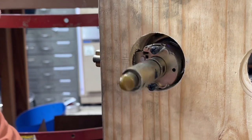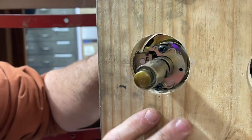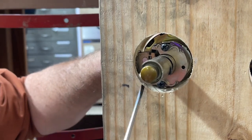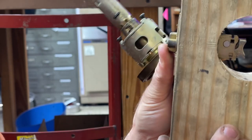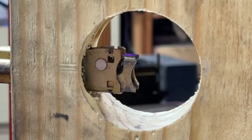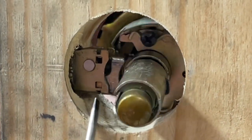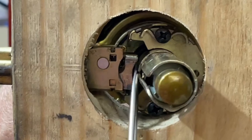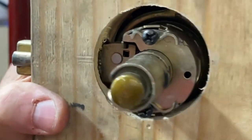This is where it trips up everybody — how do I get that off? Normally, just like with the Westlock, you turn it and it'll let you pull it off. But sometimes it won't, so you do have to be prepared to grab your flathead screwdriver and stick it in there and get it off. Most of the time it comes off fairly easily. But when you press the latch down, it does not pull the bolt in — those are two independent spring mechanisms. The hard part is putting it back on, because this has to line up with those two grooves here and here, and you physically have to push this back with a screwdriver and then guide it on.